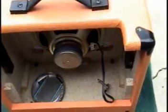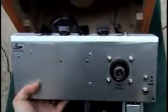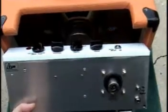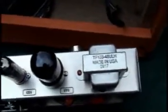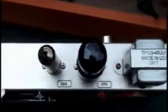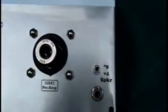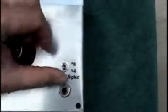First off, I started with this Hammond chassis which I had to modify so that it would fit into the opening of the original chassis. I chose to go with a typical 6V6 class-A operation with a Champ output transformer. There's your rectifier tube, and on the back side poking out like a Weber carburetor is your 12AX7 tube and your speaker output jack with a switch to go 4 ohms.